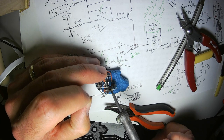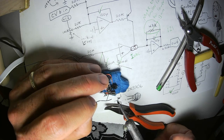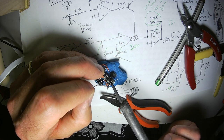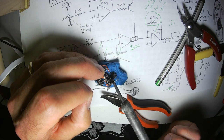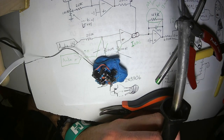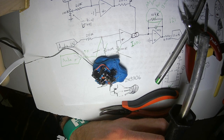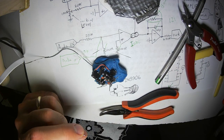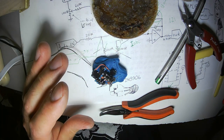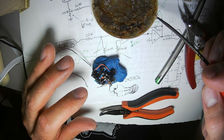Tried to use a little bit of solder that I accidentally melted off the spool. See, there we go. The transistor lead is not wetting. Get out the flux. Oatey number 5 lead free solder paste. This is for plumbing usually, but it works great for electronics too.